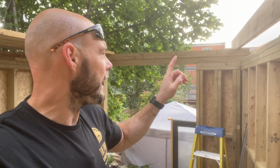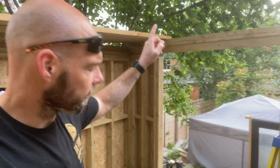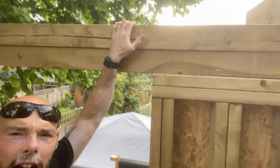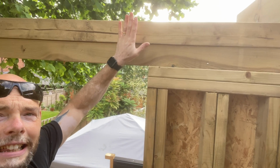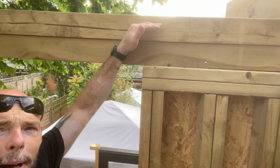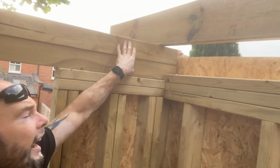The plan is going to be, first things first, the steel is going to be here Wednesday. So what I'm going to do, I do this literally all the time, is create a fake joist, or a temporary joist if you will. These are 4x3s which I've ordered, which stay up there. That is taller than the 160mm, so 160mm steel is about there, so it's about 30mm extra. This roof will be pivoted onto that.